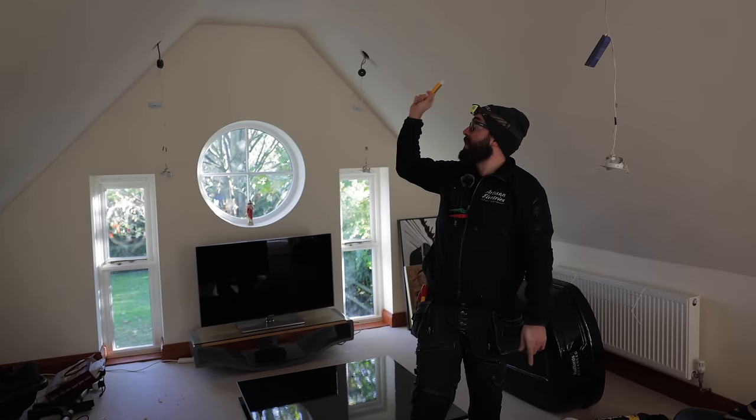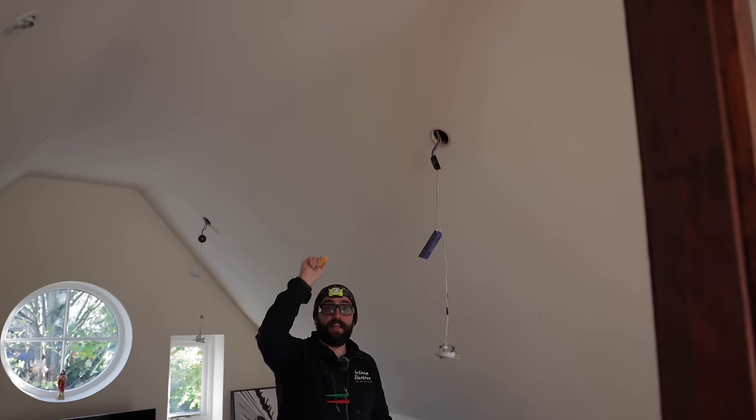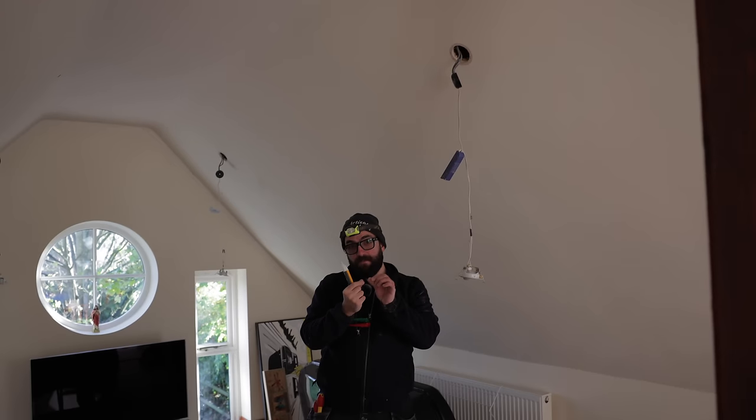They sort of went in an S shape around. I'm gonna split it here. I'm gonna see if it's the cable going back that way or going this way. And I'll do exactly the same, see where the fault is, and I can do an R1, R2 to prove which leg is which.